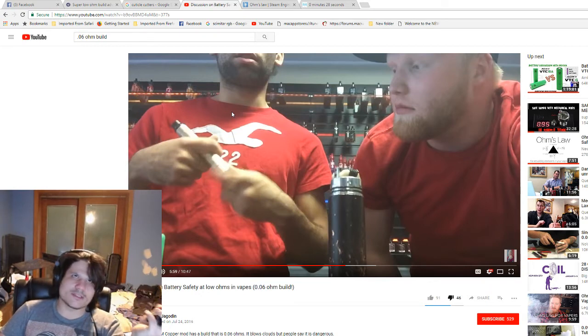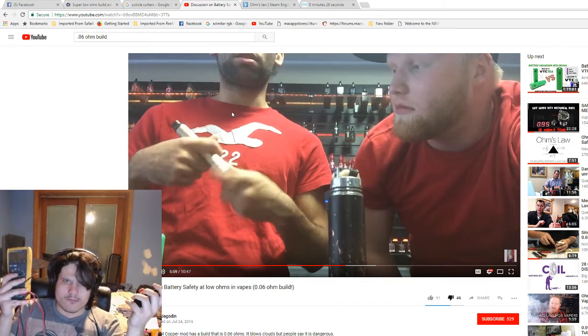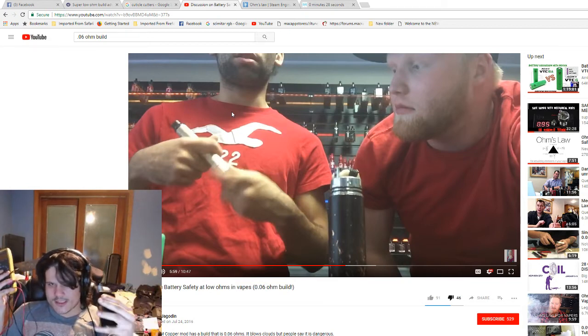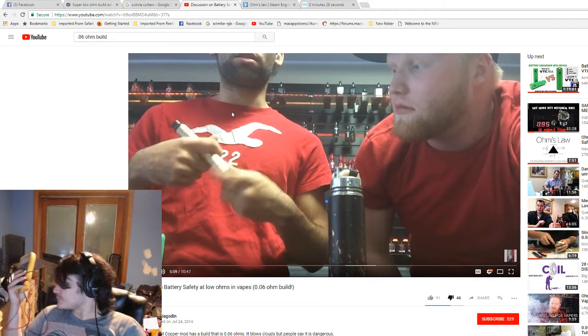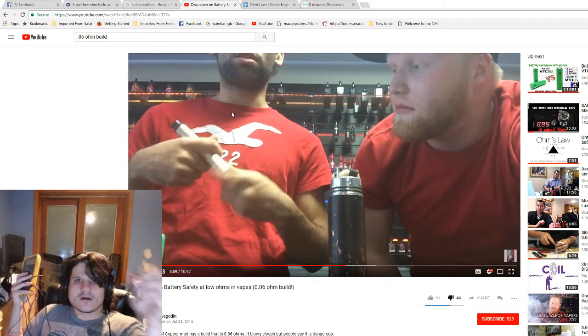He's not even feeling the battery, even if this were an accurate measurement of just about anything. I mean, guys, really, I don't think I have to spell this out for too many people out there. I'm sure there are tons of rational people who see the problem with saying, feel that battery, is it hot? No. Well, do you guys know what the generally accepted operating maximum of an 18650 battery is? It's about 45 degrees Celsius. It'll get warm to the touch.